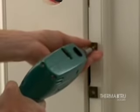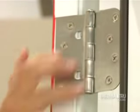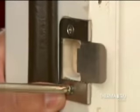Now it is time to open the door to complete the jamb fastening and install the hardware. Remove the transport clip, then open and close the door to check for smooth operation. With the door open, check that the long hinge screws were pre-installed. If not, drill ⅛-inch diameter pilot holes and install the number 10 by 2½-inch hinge screws provided to anchor the door frame and prevent sagging. Then install the adjustable strike plate — drill ⅛-inch pilot holes and place the two number 7 by 2-inch screws through the strike plate mounting holes. Adjust the strike in and out for proper latching and tighten the mounting screws.